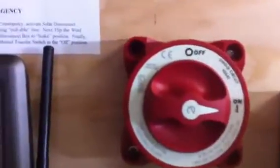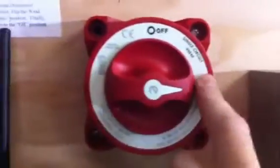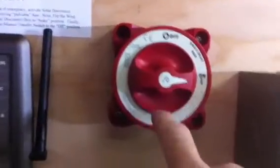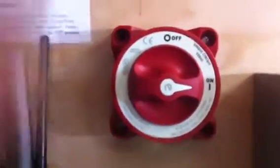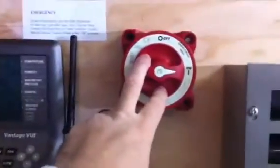It's really easy — you just buy another transfer switch. You're going to hook your common positive to the common on this, and connect your number one lead between it and the battery bank, or in my case just a bus bar that starts the whole thing. The bus bar is in turn connected to this, and my common from this transfer switch is connected between this and the physical battery bank. It's a good idea to have that so you can kill every possible power source when you're working on your equipment.